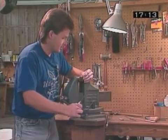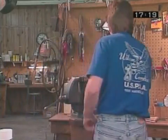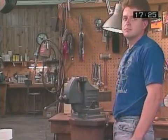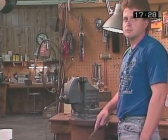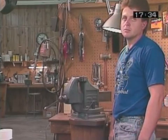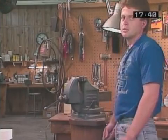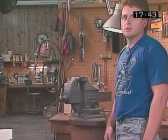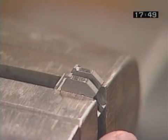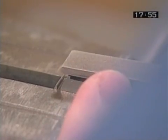And then after you get that cut and looking like you want it, you need to cut the height of the hooks down. Now we don't recommend you go below 18 or 20 thousandths. You get into a lot of safety problems if you go any lower than that. They usually come a little taller to give you plenty of material to work with, and we'll cut them. Some people use a feeler gauge laid on top of it to cut them, but you can eyeball it too.